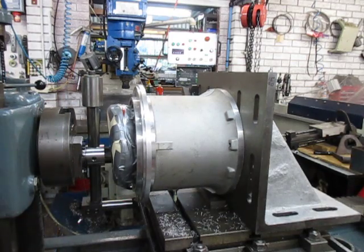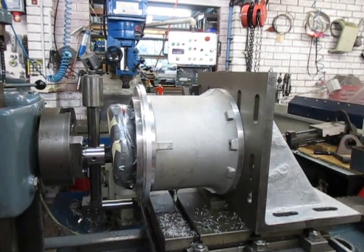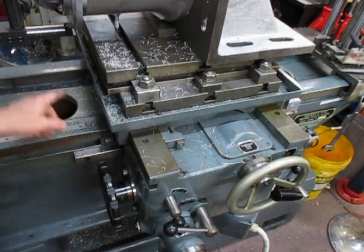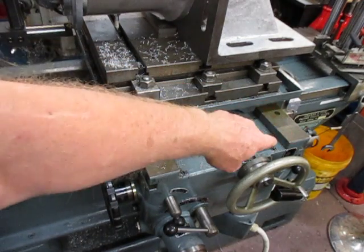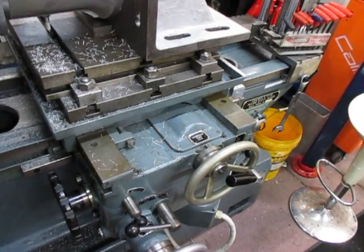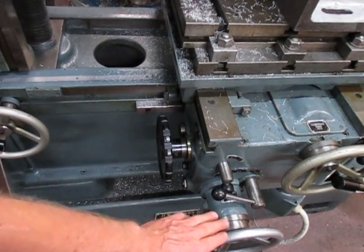We're running on low speed, geared down to 45 RPM — in fact running at about 40 Hz — and we're slowly cutting. The cross traverse is locked, it's all centered and lined up, and the engagement unit is engaged for feed. But we're not using the auto feed because it's too fast given how slow we're running.